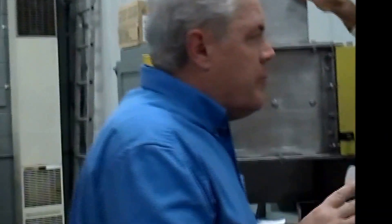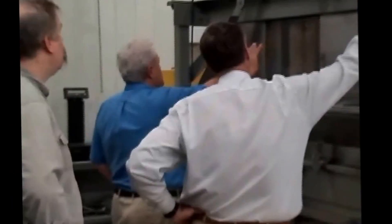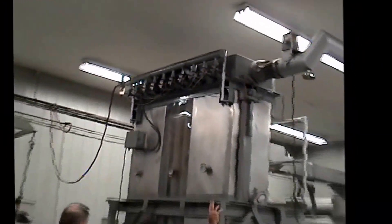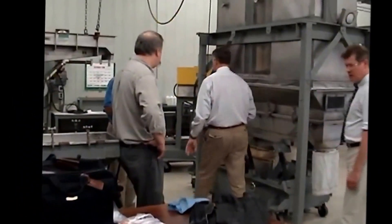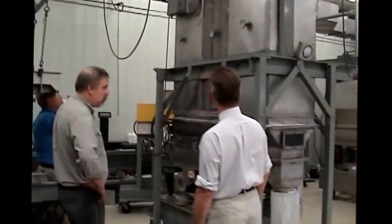We have some clumps — they tend to roll to the bottom of the pile. The material feeding out now is light brown compared to the fines that came out in the beginning. The fines were the fines that blew through. This was the stuff that was stuck in the dryer because it is clumpy. So now we're looking at a declumper, which would prevent that from occurring. Here we're looking at a much larger model — I see combustion burners up there. Anyway, it's a more compact version of a dryer, about the same as what we're looking at here. Just an option being considered.